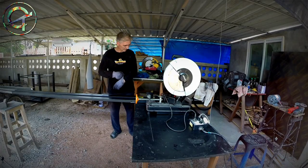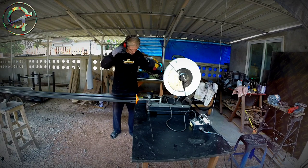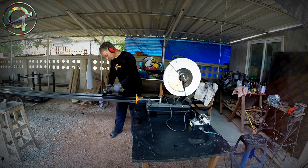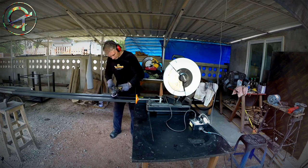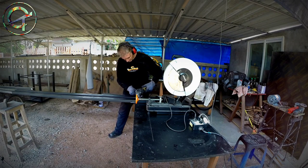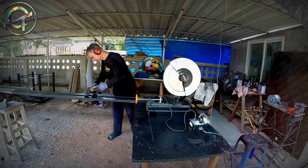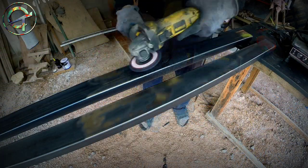Okay, my fellow carpenters, I'm building a 5-foot bed with mild steel rectangular shape profiles, 7x4 cm. Steel made with the hot roll process, therefore very dirty profiles, and as you know, TIG weld doesn't like dirtiness, greasiness at all. I begin the project by cleaning my steel with a nylon disc and a grinder.